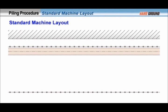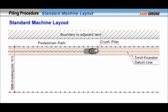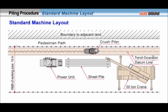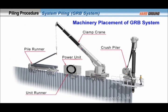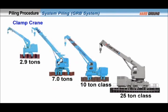The necessary equipment for a standard piling site is comprised of a Supercrush Piler, a power unit for driving the press-in machine main body, a service crane, and a mini backhoe for taking care of displaced soil. When a service crane cannot approach the construction site, piling can still be performed in narrow spaces, slopes, and over water by using a clamp crane that moves atop the installed piles.